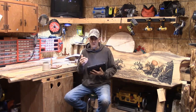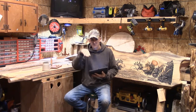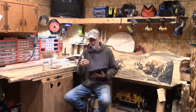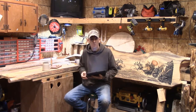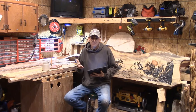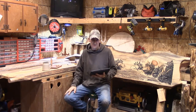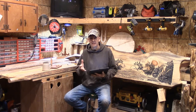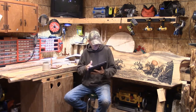Depending on what I'm doing, if it's a piece I can't secure very well to my table, I would specifically use a down-cut mill because the force pushes the material back onto the table. I've used a large up-cut and pulled material right off my table out of clamps — which is coincidentally why we now screw everything to the spoiler board. An up-cut end mill is pretty powerful and the larger ones can pull your material right off your table. But for milling really deep pockets, I like an up-cut because it pulls the chips up and out, and the dust collector can suck them up more easily.